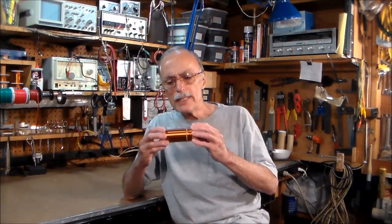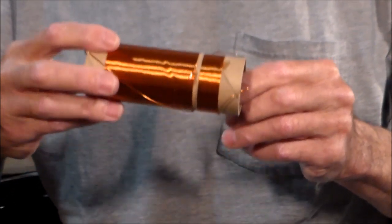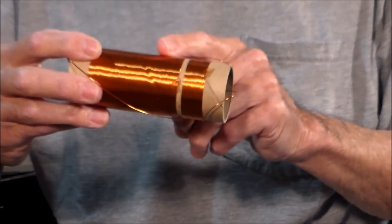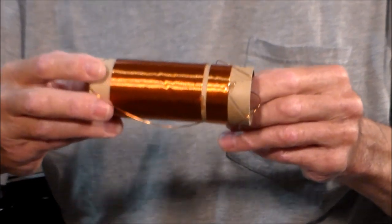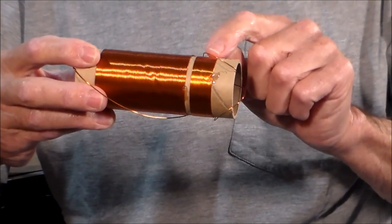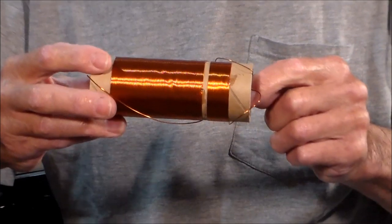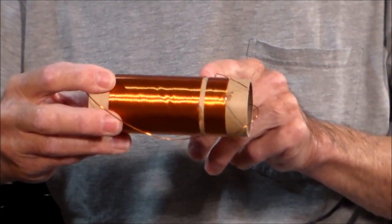Here is an example of a typical antenna coupler. All antenna couplers employ two coils wound on the same form. There's a larger coil — the main tuning coil — and a smaller coil, the antenna coil. In this case, my large coil is 90 turns of number 22 magnet wire, and my small antenna coil is 25 turns of number 24 magnet wire, wound on the same form, spaced about an eighth of an inch apart.